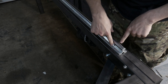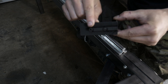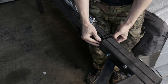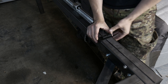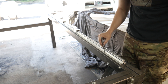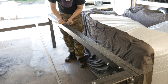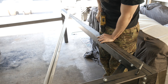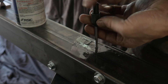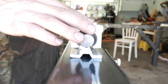The way we are going to mount the rails is there are mounting holes along the bottom. I 3D printed a little fixture that has two holes perfectly lined up with the holes on the rail, and all I'm going to do is put this on the frame and feed the drill bit right into it — that keeps the spacing consistent throughout the length of the tubing. I went ahead and marked each hole so I know where to put the fixture when drilling. Honestly I could have just measured them out, but it was only a 30-minute print and it was worth the consistency. The tedious part was tapping each of the holes, but the machine screws went in really well. Once that side was finished I did the exact same thing to the other side.